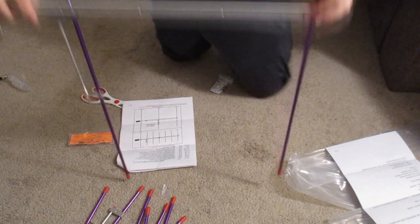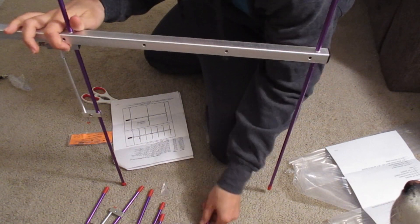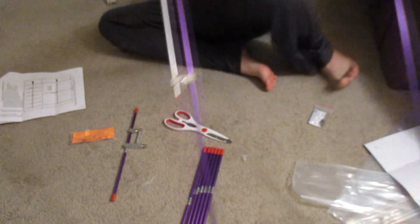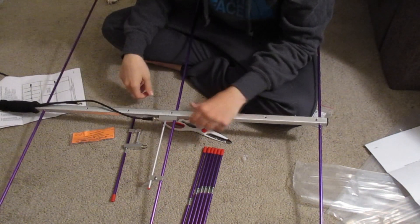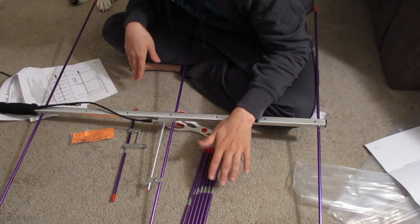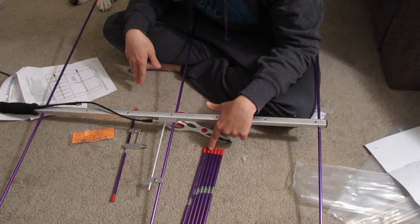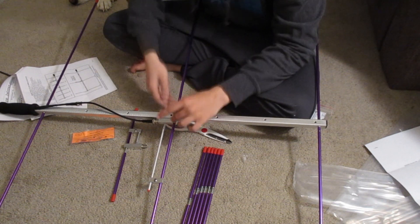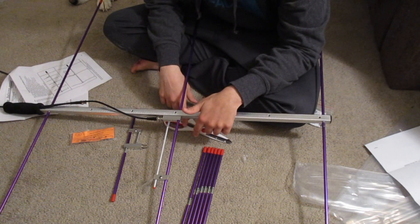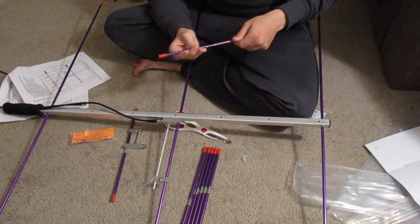Now that we have those pieces in there we can start connecting the 70 centimeter elements. There are a few more of these so we're going to group them to make sure they are with their matching parts. Each of these is an individual element — I was just overthinking it. I have them separated from smallest to largest. The first three are actually the same size: four and seven-eighths inch. Then it goes up to five inch, five and one-quarter inch, six inch, and six and one-half inch. Let's go ahead and get these first four and seven-eighths inch ones on.